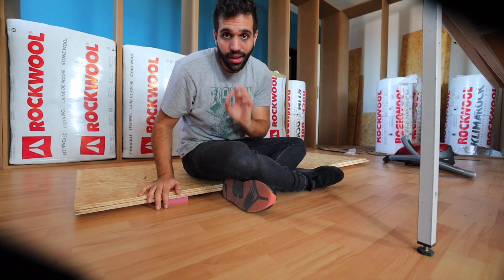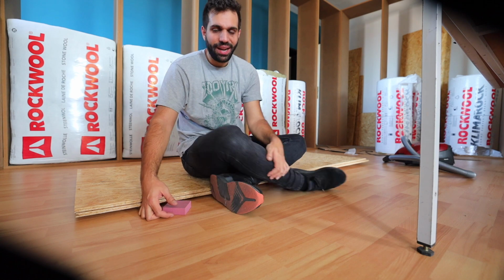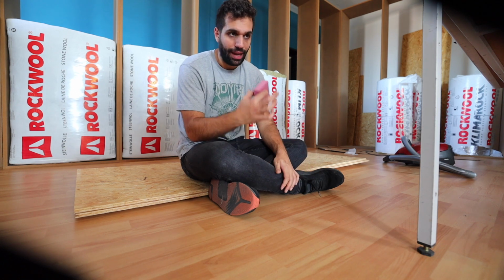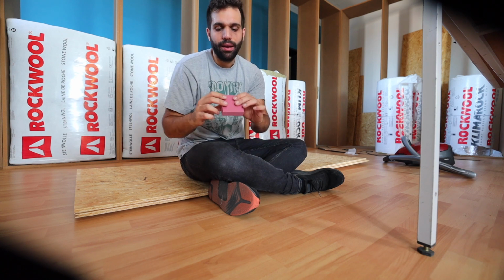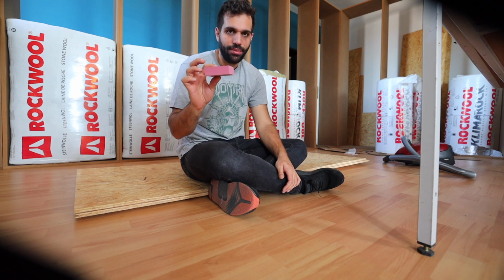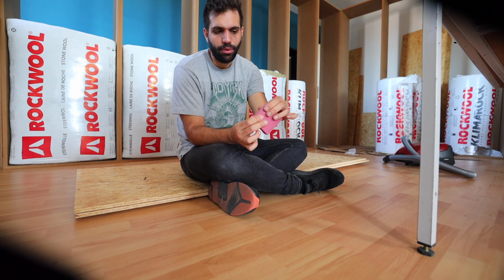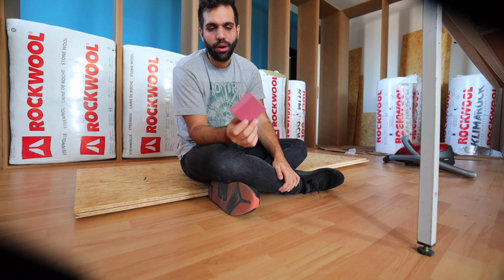So this right here is the floor construction, and there's a big thing that just makes me really mad. These are the wrong ones. I ordered them with a company that sells them and also calculates everything that has to do with it. I paid for the stuff plus the calculation, and they told me under load it will bend to 10%. This is like 2.5 centimeters. So I calculated how much of a gap I will have underneath, and it's less because it's squishing more than it should. It shouldn't move more than 2.5 millimeters if you have 100 kilo on top. And I just walked over it. It moves more, and I'm not 100 kilograms.